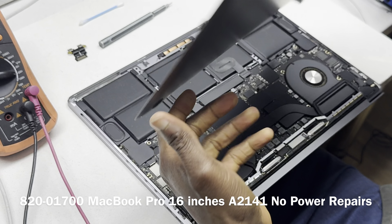That's connection number one. The other one is the flex cable that comes from the board onto the battery mini board. This is the main battery power line — that's about 12-point-something volts. This lower voltage line is about 3-point-something volts, or sometimes 2-point-something volts — this is a data line.